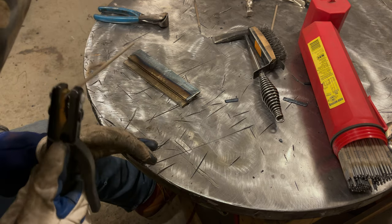So I'm sure you can see that all of these require kind of the same thing as beads on plate. You need to be able to weld a straight line that's consistent. This is obviously a lot harder than just running a bead on plate, but not really that hard at all. So you don't want to throw this stuff out just yet. These things will be awesome when I do the next video in this series where I'm doing fillet welds. This will work as an upright plate for you. So don't throw these out. Not to mention, you can run a bunch of passes on here overlapping to get more use out of this. Burn up as many rods as you can on this.